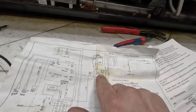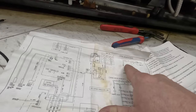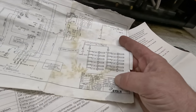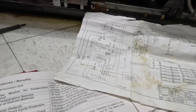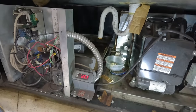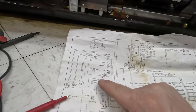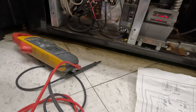So here's the run capacitor relay, high pressure switch, compressor overloads, condenser fans. I see ballast, ballast, ballast. Condensate evaporator pan, condensate evaporator fan. This does have like a heated pan back here — you can see that dirty nasty looking thing, so that's how it does that. I don't see any heated elements, so I bet that must be ballasts — probably lighting circuits of some sort.